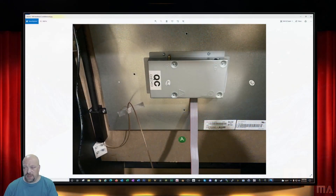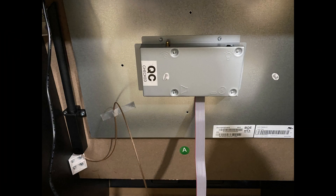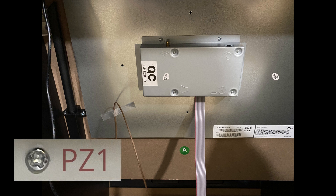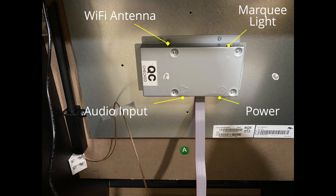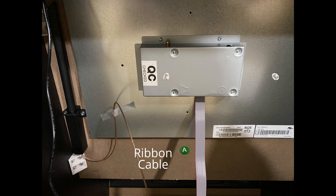Once you've done that, you'll see the back side of the arcade is opened up. Inside, there is a panel that contains the existing original circuit board used for the Arcade 1-Up processing. We need to remove this — there are screws with a PZ1 screw bit head. Remove the four screws around the case. Also make sure to disconnect any audio connections and disconnect the ribbon cable so that the box is completely disconnected. The ribbon cable coming out of the bottom goes down to the back of the control panel — go ahead and disconnect that.